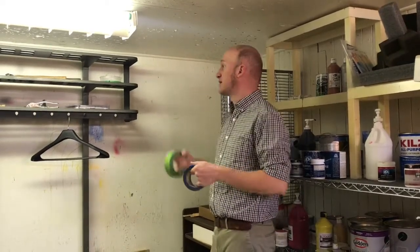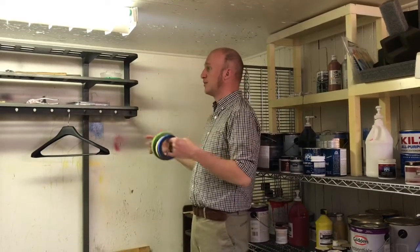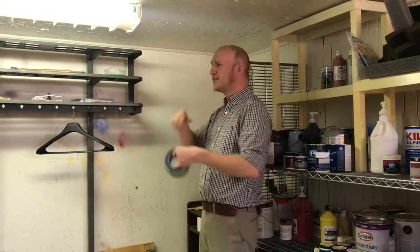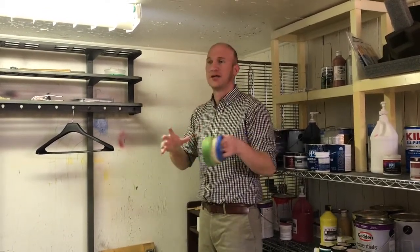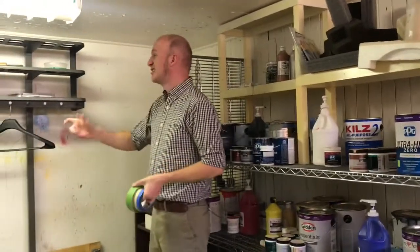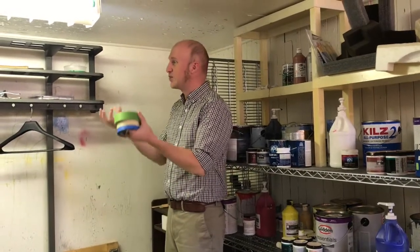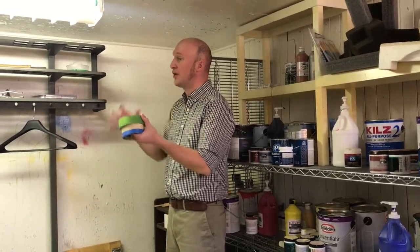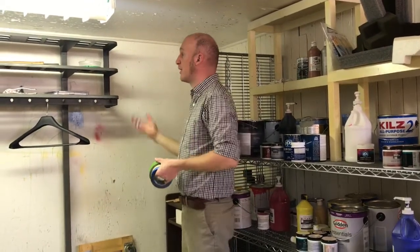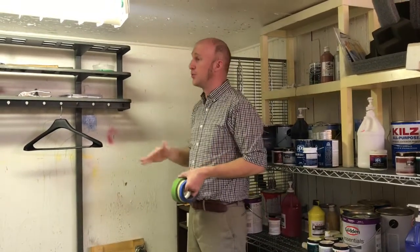So if you're going to paint something in the wood shop — if you make your own dresser or rehab something, like an old table from Craigslist — and you're using liquid paint, not spray paint, I highly suggest taking some sandpaper and roughing it up a little bit. It feels like you're damaging the wood, but really you're grinding it so it has some tooth. That gives the paint something to grab onto. If you ever find paint on a wall or furniture that's scraping off, it's because the surface is too smooth.